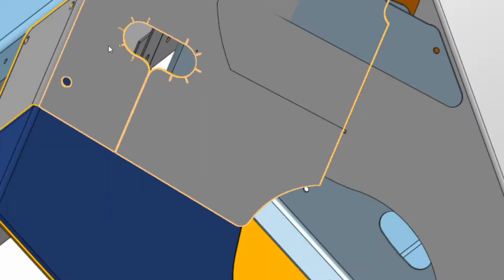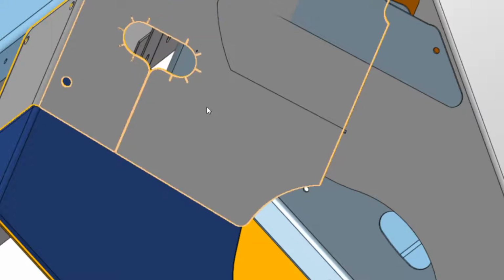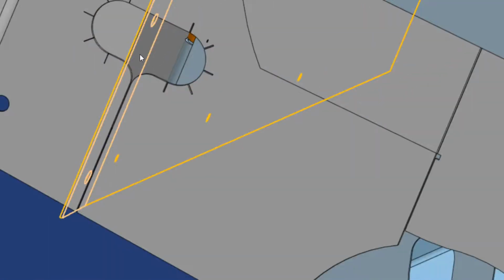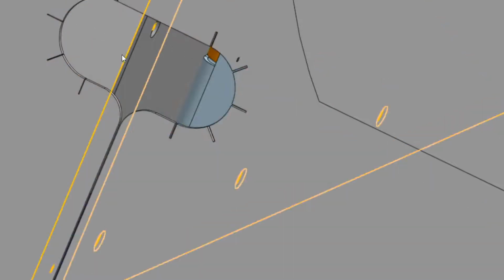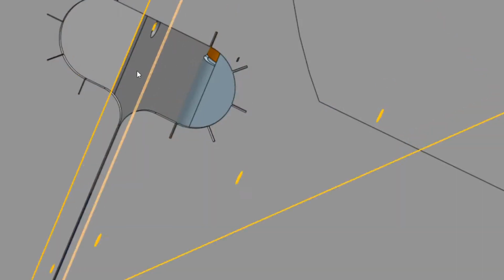It comes out at an angle and then dives straight down once it's out of this hole or out of this slot. Notice that there are some openings or little slits around the edge of this so that you kind of have petals. I explained that in the tin assembly, but in this case I think you'd bend some of these petals on this forward part back in just a little bit to kind of parallel the oil line as it angles through here, and I'd bend some of these back ones forward a little bit to parallel that line as it comes through there, and these on the top and bottom you can bend out in order to accommodate that oil line.